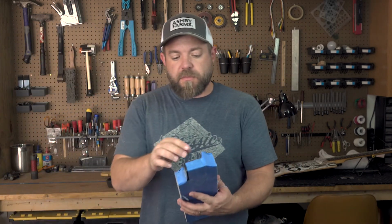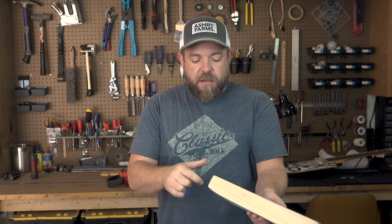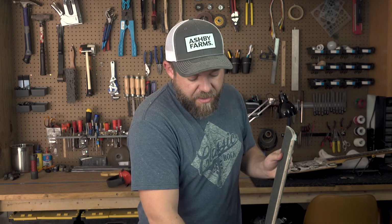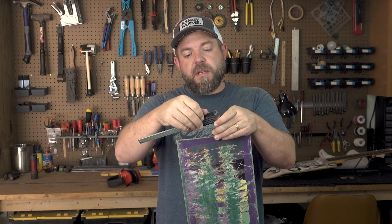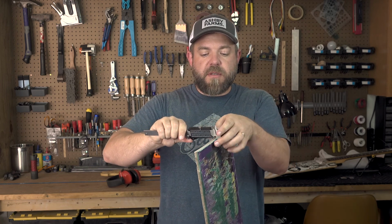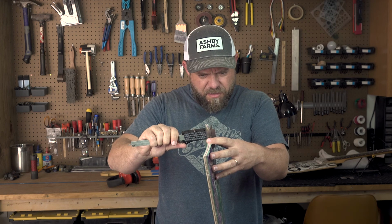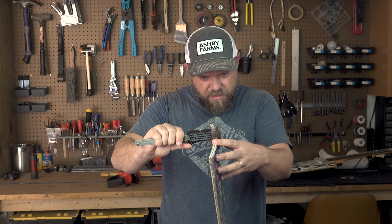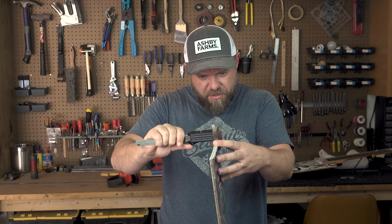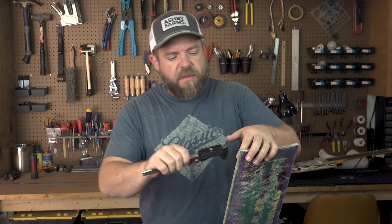All right, we'll keep taking the tape off, take it back over to the table saw, and we'll shave these things down. Oh, lots of different ways, by the way. You can measure the thickness of this. Easiest way, though, is with a set of calipers. I love these. These are an Amazon purchase. So, looks like it's roughly 7/16. I'll take the grip tape off. Yeah, we'll make it a hair over 3/8 is what we'll take off.